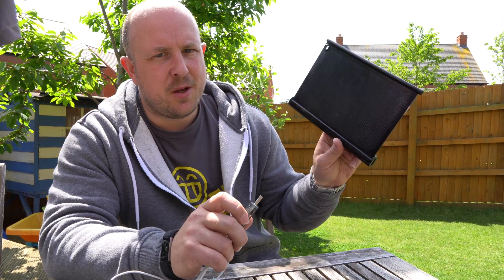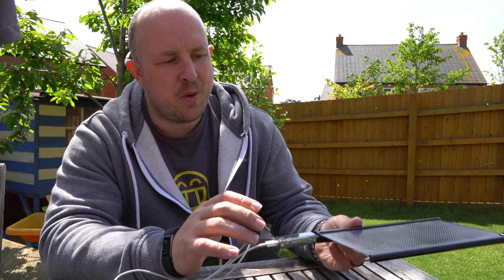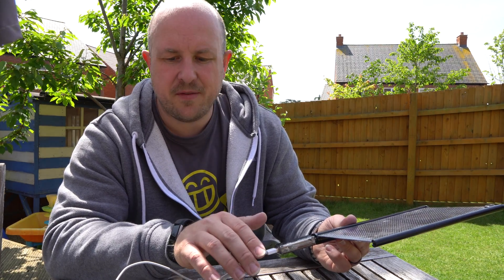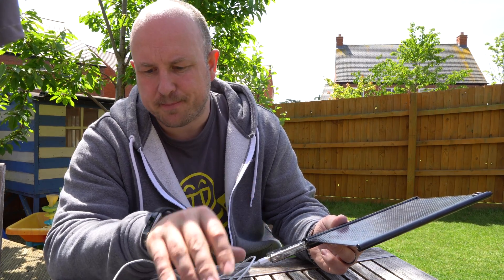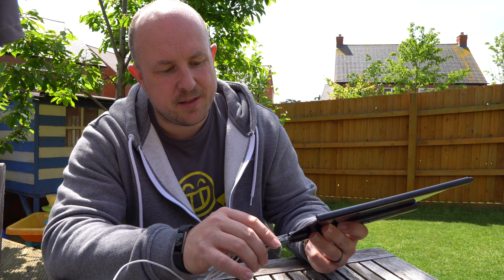I've got to be honest — that's a little bit disappointing. This SolarAid is really like one third of the solar panel lineup, and I get 0.55 to 0.6 amps from it. So that's basically just under half of what the three Anker panels are getting. I just don't know if this one panel is more efficient, or if there's some throttling from having the two USB ports impacting the output. It's now up to 0.66 amps on the SolarAid. I'm not too sure — I don't have a load of panels to compare against.